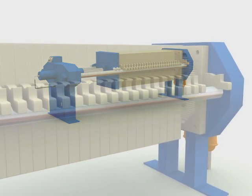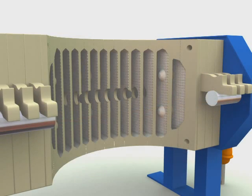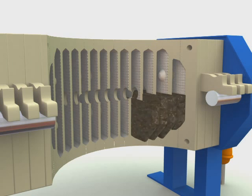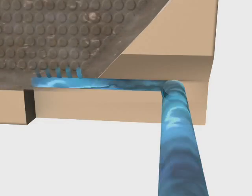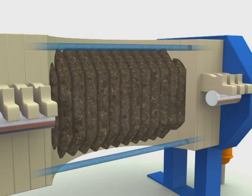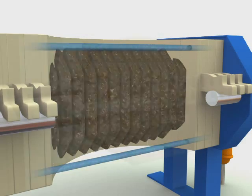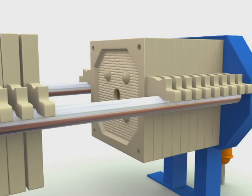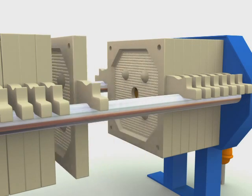The plates of the plate pack support a filter media, which may be a woven cloth, felted cloth, coated media, or paper. Slurry is pumped into the chamber against the filter media. Liquid passes through the filter cloth and exits through the filtration ports of the filter plate. The solids collect on the surface of the media within the chambers until the chamber is full. The cake may be washed or blown dry if necessary, and filter cakes are then discharged and the filtration cycle is complete.